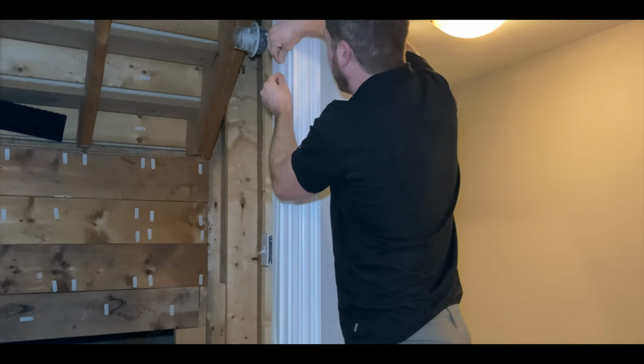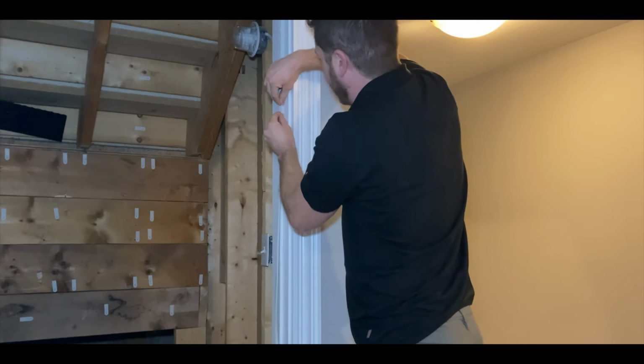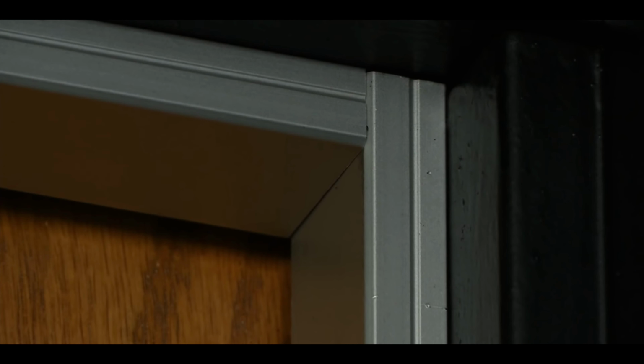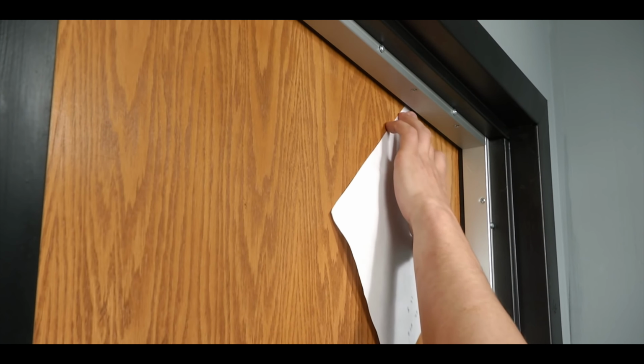So now that you have your two doors installed, usually you would just add some acoustical sealant around the door casing and where the door meets the casing, and also some weather stripping where the door meets the casing. But to go a step further, you should install a door seal kit. A kit like this will cost more money than just buying a weather strip and some acoustic sealant, but it will also work better at sealing all the gap around the door and door casing. They also last longer, because the weather strip that you add around the door is a self-adhesive weather strip.